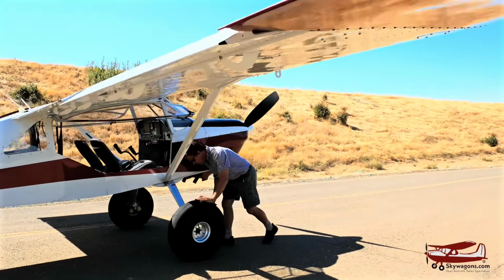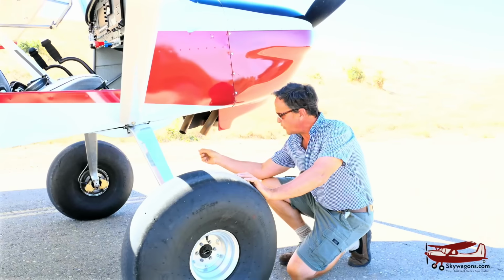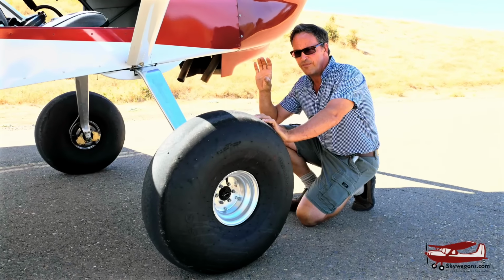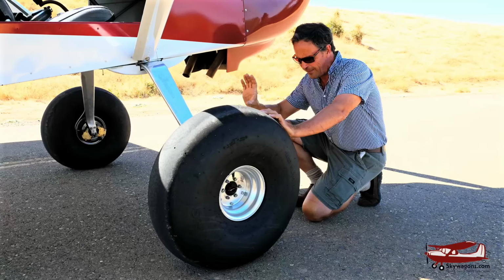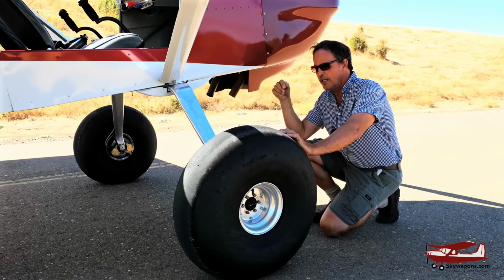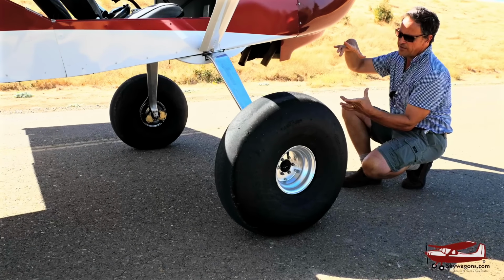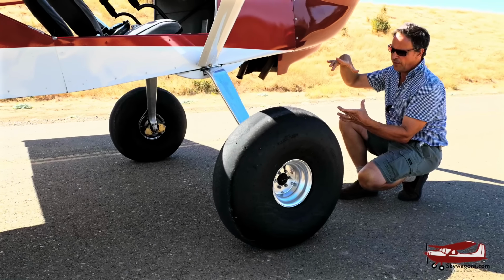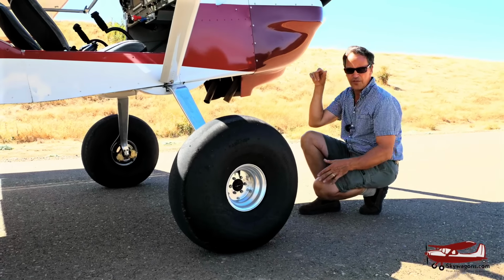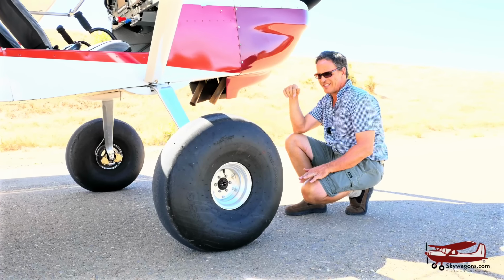So on each of the brakes, there's two individual single calipers, which work together, of course, whereas some of the Cessnas have the double puck brakes where they have two individual calipers inside each caliper themselves with one line. So this is two separate ones, but it's just the extra braking, because when you've got a large tire like this, if your brake disc is this big and your tire is this big, the radius is enormous, so it reduces it almost to ABS, so it decelerates you, but it doesn't skid and flip you over.